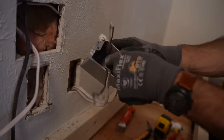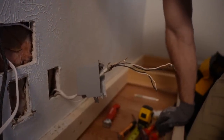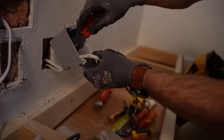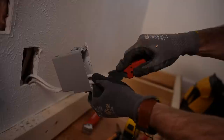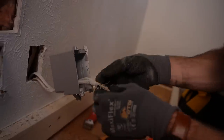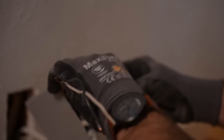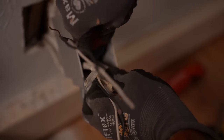Now I'm going to give myself a little bit more because I had to cut off these grounds. With a safety knife or box cutter, I'm going to run the length of the jacket in the box, minding my fingers. Do your best to stay towards the middle where you'll only score the ground — not the hot wire insulation, as that would be most dangerous. Then fold your wires in the opposite direction of your jacket, just press through, and get them out.